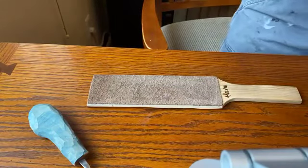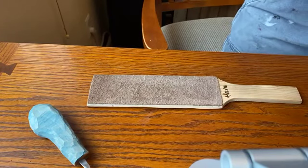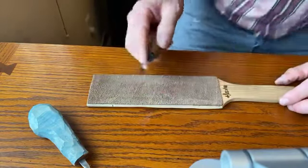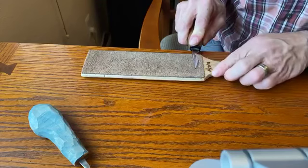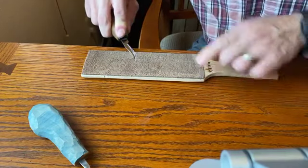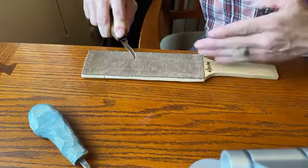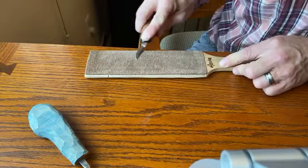So let's go ahead and let's just strop again. Let me strop another favorite knife of mine, the scimitar blade, okay? Just real quick, we'll cover the basics, okay? Lay your knife flat, tip it to the sharp of the edge, touch of the strop. As we're pulling away, we're altering the angle of the blade so that the sharp of the blade is always straight away from where we're pulling, right? Do it again. Tip it, pull away.